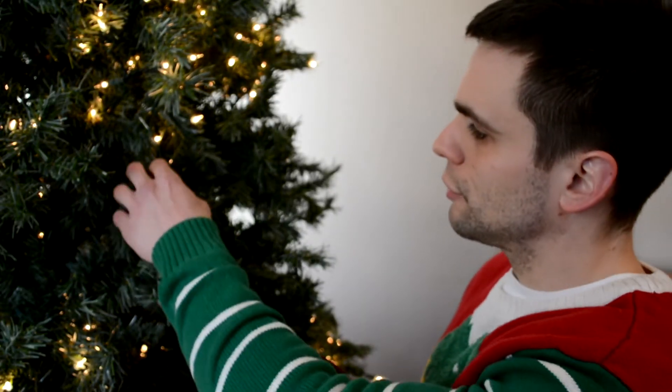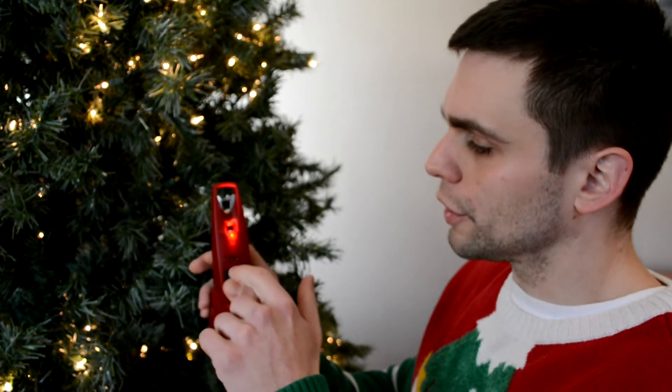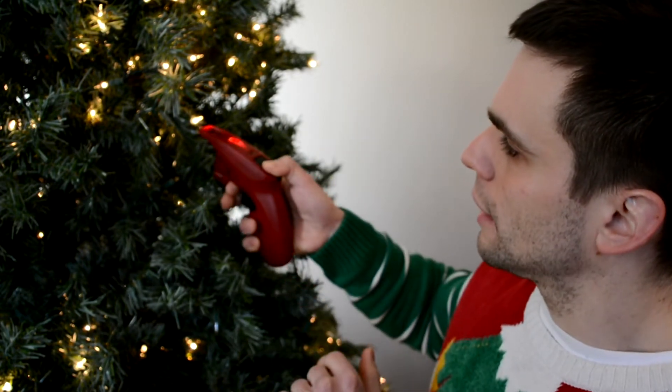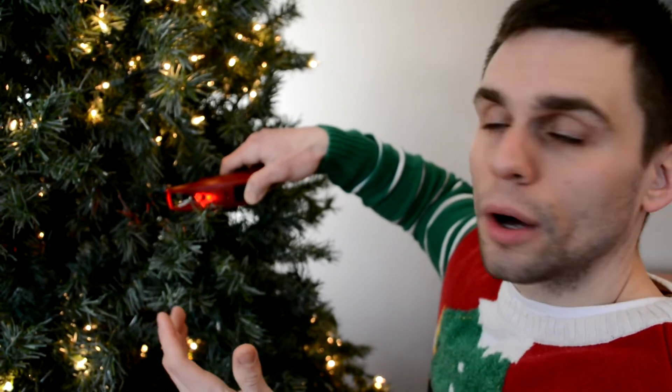Now let's actually show a demo and see how it works. As you can see, I have the tree lit up and there is a section of lights here that's unlit. I'm going to show you how we can fix that very easily. First, I want to show you the little voltage meter I was telling you about earlier. When you press that button, the voltage meter lights up. When you go by a hot light — a light that's working — you see it beep. And when I go by a dead light, you can see that, just like we thought, there's a problem with the electricity going to it.